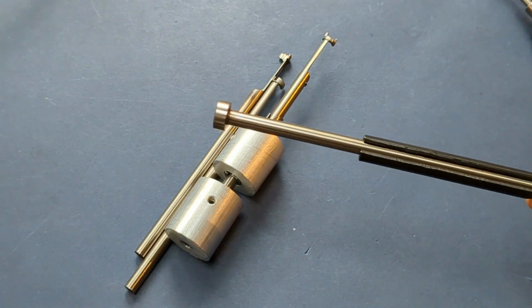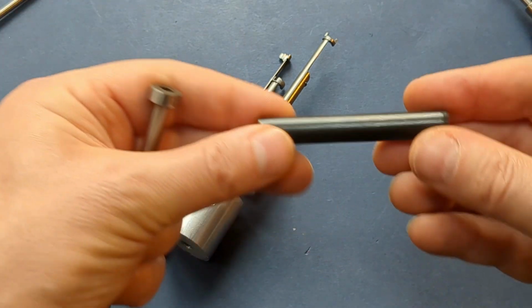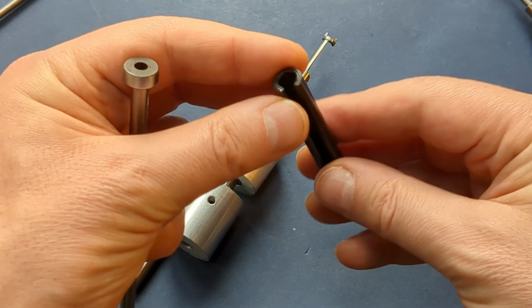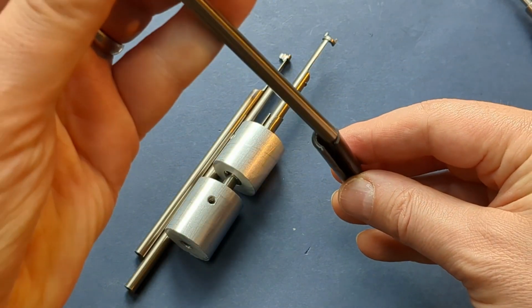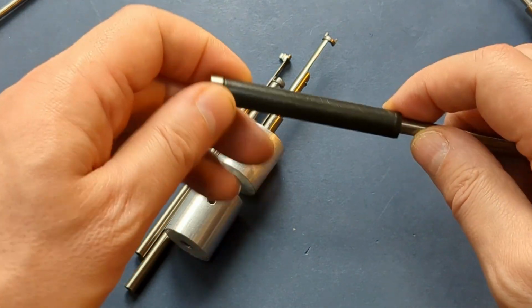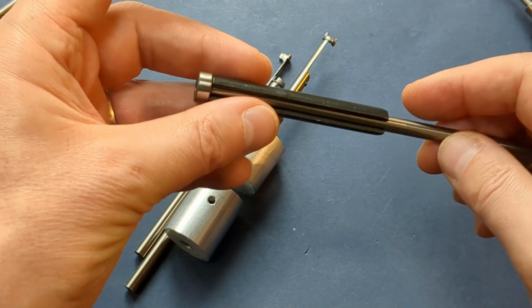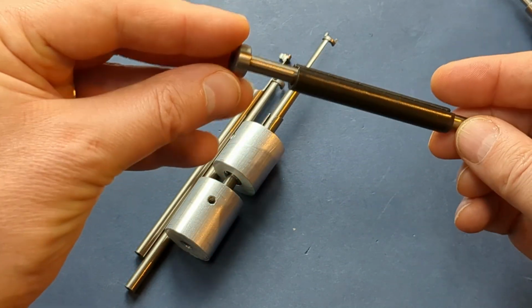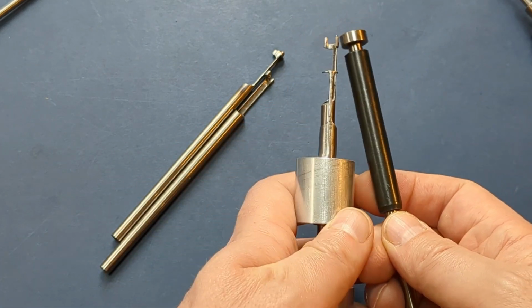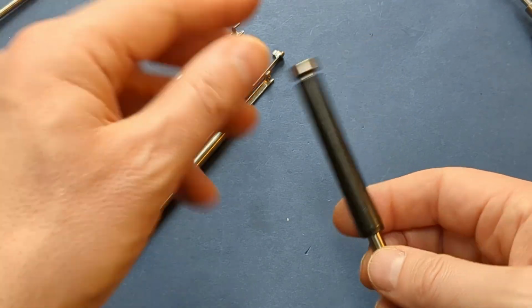But for Profile, you use this bit as the tensioner, and then this is a 10mm spring steel roll pin, which has a 6mm bore. You can see there that matches that quite nicely. And then you have to grind quite a lot of material off that, because actually it's 2mm thick on there. You have to grind quite a lot of material off it to get it down to the 7.5mm and end up looking like that. So that's the raw materials.